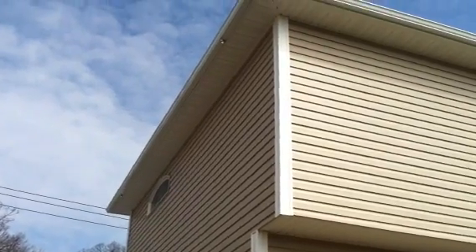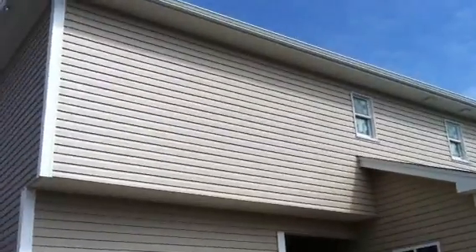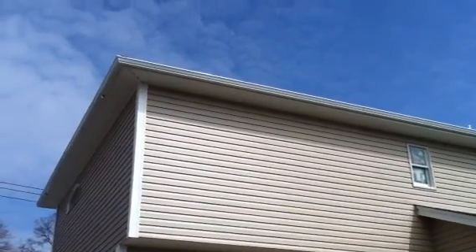You can see that the house is getting the gutters installed. This rear gutter is about 45 feet long. It's a seamless gutter — one piece that comes out of a machine bent. We measure it end to end to cut it and install it.